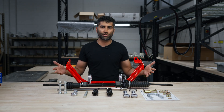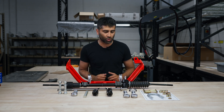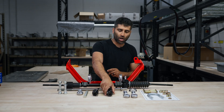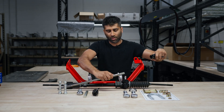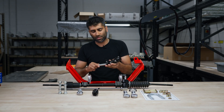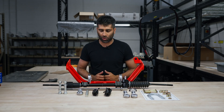We check the bolt holes, make sure there's enough room for powder coating, check the clearances for the rack clamps, and make sure the U-joints are good. We check the threads on all components, making sure everything is smooth. When we check the splines, we check them with the mating component as well to ensure they work. The double Ds are checked as well, and oftentimes you'll see these come pre-assembled from us as part of our QC process.